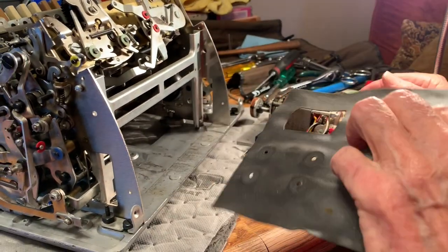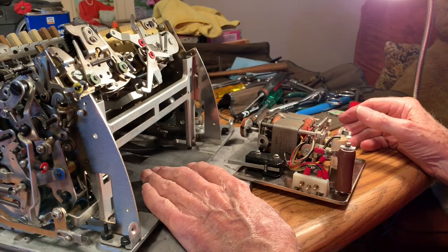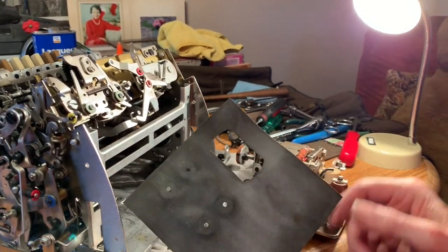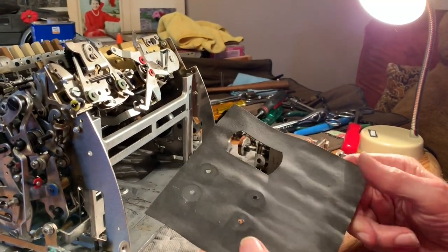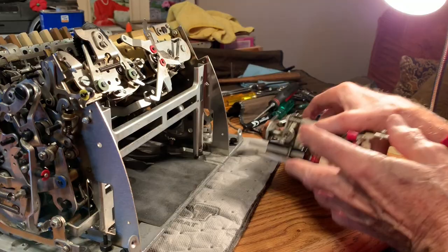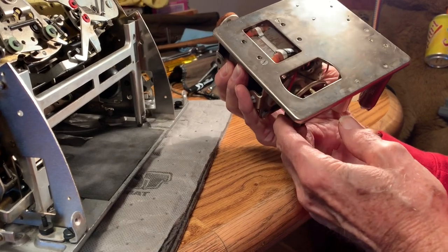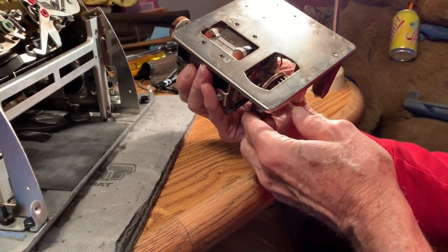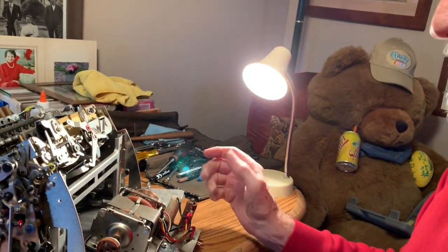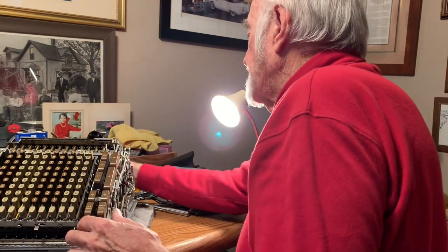Okay, we're going to put the motor back in it. There's this little protector card — actually a fiber board — that goes in under here to help take away some of the vibration and noise. When we put the motor in, there is a big hole in the bottom of the motor. That is so that you could get at these points, which control the speed of the motor — so you could turn it upside down and adjust that without taking the motor out. That was the whole point of that. Okay, let's see if the gears are turning — that'll be the next thing.